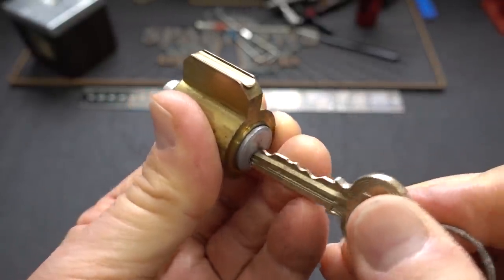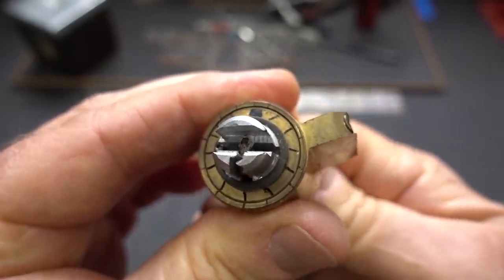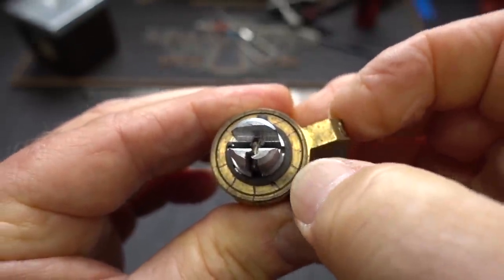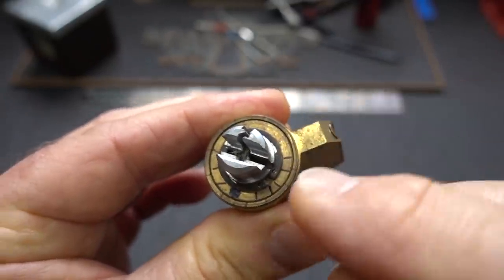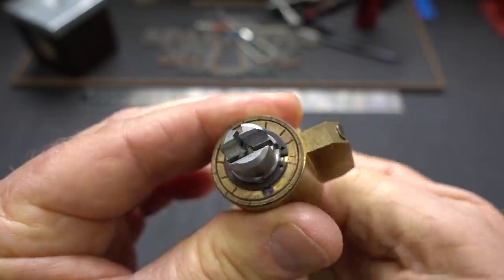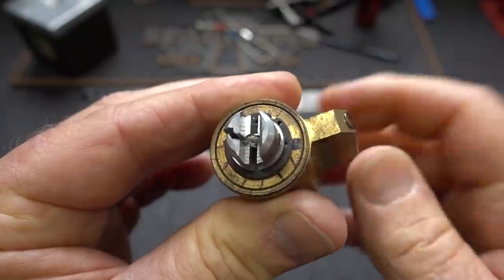These are usually pretty high quality locks, pretty high tolerance. They have put a roll pin through these to keep bypass tools from being jammed inside of there. You notice this one only turns that inner core — the actuator fits right in that slot. So, again, you turn that and obviously you're going to get into the door. So that's one key. There's also a second key — this is the landlord's key — and you'll notice the outer or master ring, that's why these are called master ring locks, then turns.